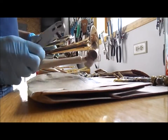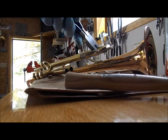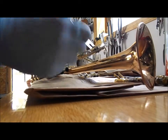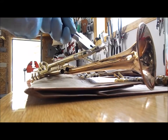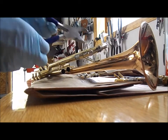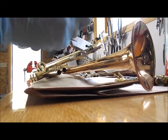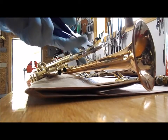I got a small mallet here, rawhide, because you don't want to be hitting it too hard. You hit it too hard, you're just going to break all the solder joints off. So you clamp the pliers on, and then what you should be doing is setting it so that the set screw doesn't crush into that. It's so you can hold down as tight as you want on this part of the handle, but that set screw bottoms out, so all you're doing is catching this little bit of a lip there. And you want to make sure too that you set the pliers the right way. This is obviously the incorrect way of doing it, so you want to make sure that you're using all of that surface area here to push against and out. So I'm hoping that a few taps here will break this loose. If not, we'll have to use some heat.